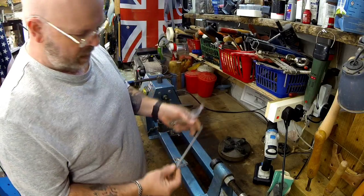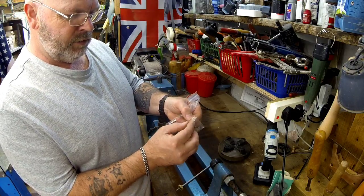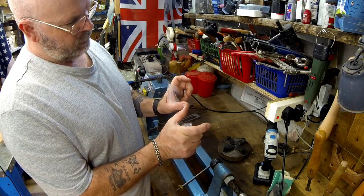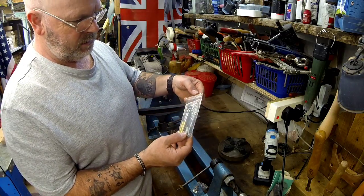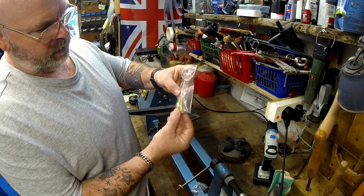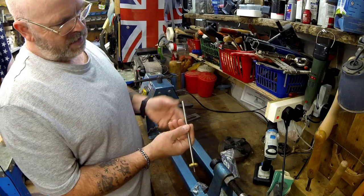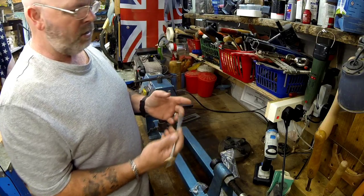So we'll have to go to plan B. With this pen turning mandrel, I've only got two bushes, whereas a lot of others give you at least three — one at either end and one in between when you've cut two pieces of wood. I'll have to get around that somehow — I think I'll have to turn one piece at a time. These are the pen parts, which I'll show as we go along.